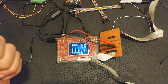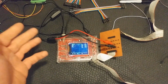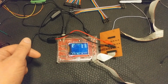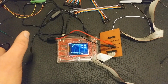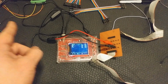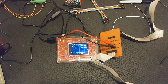So we found the feedback and the control for the VFD, and luckily it's pretty straightforward and pretty simple. Not as simple as a potentiometer you just slide, but we can still take an Arduino with a potentiometer and read that, and then generate that PWM to control the VFD. Now, this one is not the same as that feedback. The feedback changed the reading in hertz, the number of waveforms per second. Whereas this one, pulse width modulation, changes the amount of high on every square versus the amount of low on every square. And we also saw that it was a pretty consistent 80-something hertz. If I pull it up one more time.